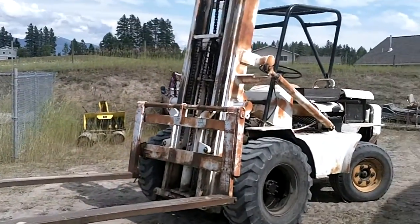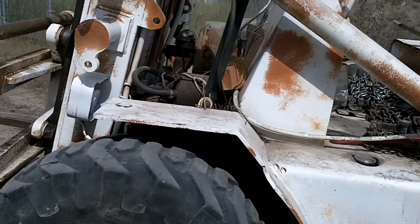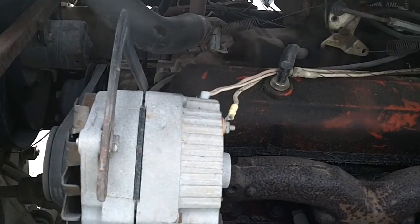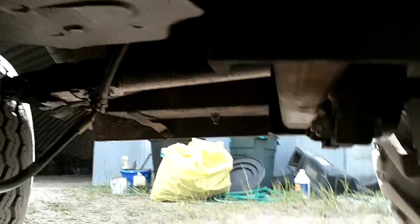This is our Baker York forklift — it's kind of a family deal. We all tracked down various parts and built it in my father's shop. We pulled the original motor out and put in a Chevrolet 350 running a Turbo Hydramatic 400, then used a chain drive to step the gearing down to drive the actual axle. It runs very nice. We have some heating issues we think are due to a bad radiator, but overall it runs very well.